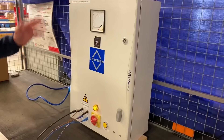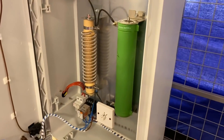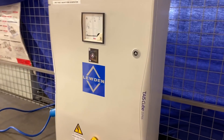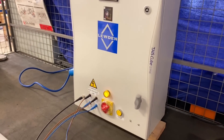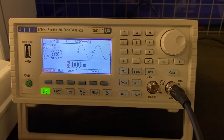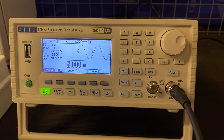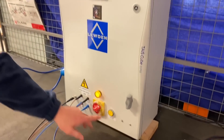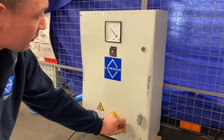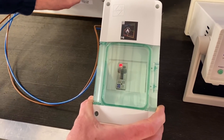We've got a second test rig here where we're going to look at an AC waveform and how it's affected by an arc. Inside this device we've got a resistor and a triac dimmer connected in parallel, generating a load current of two and a half amps — the minimum required for the AFDD to operate. We've got a signal generator connected to the rig and a scope showing us the AC waveform. With a standard AC sine wave, the AFDD is connected in series, drawing two and a half amps, and the AFDD is doing nothing — the red LED says it's healthy.